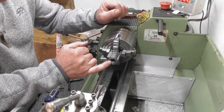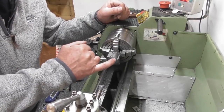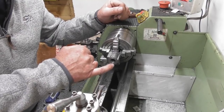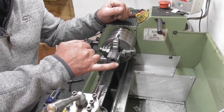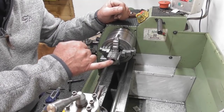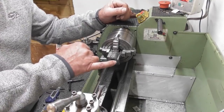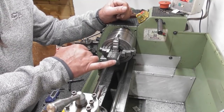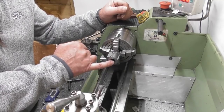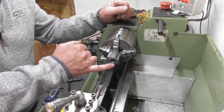It's quite an aggressive feed but I am roughing out. A series of passes through here, forward and reverse feeding, taking out spring passes. It turned out I took two final 3 thou cuts and as near as I can appreciate measuring with a telescopic on the good mic I'm at 0.625 inches. The finish is quite nice. I'm going to use the bore of this as a gauge for the piston when I make it.